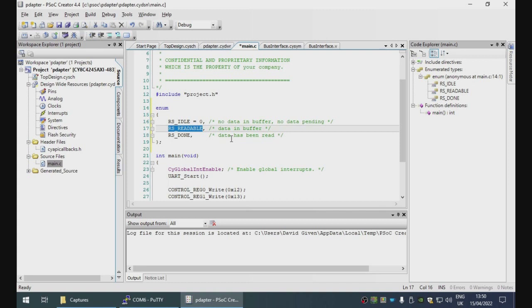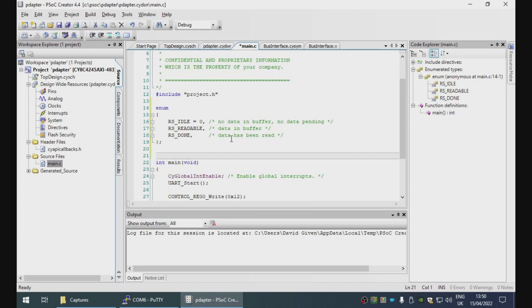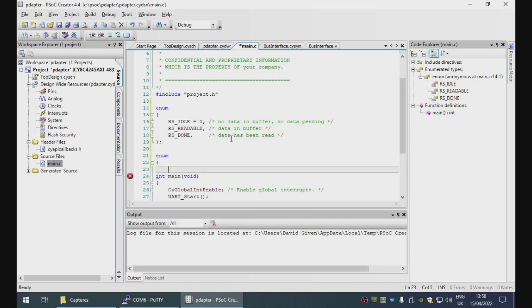It doesn't know that another byte is available, because when the Brother sets the acknowledge bit that we're about to do to tell the interface it's done the read, it doesn't know when the interface actually handles those bits. Hopefully that makes sense. I suspect it may not. Anyway, let's do the acknowledgement bit.